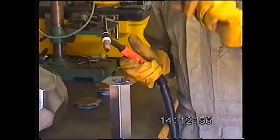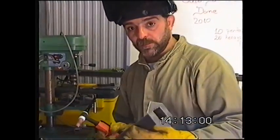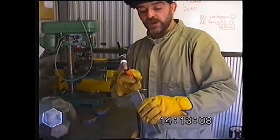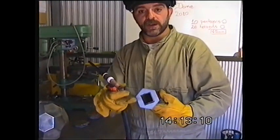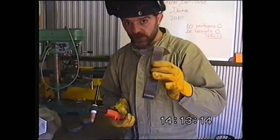A tip for you out there: when you start welding and when you're going to place the pipe, do not weld it — just tack it. Weld it once everything is done, otherwise your little square here will bow and get deformed. That's my tip.